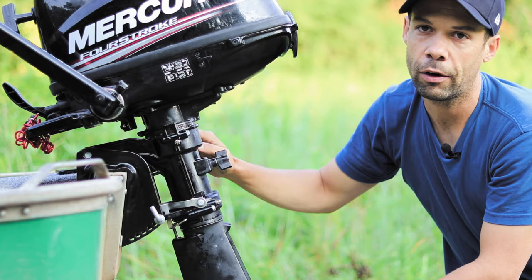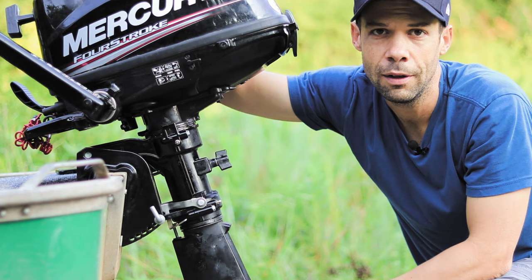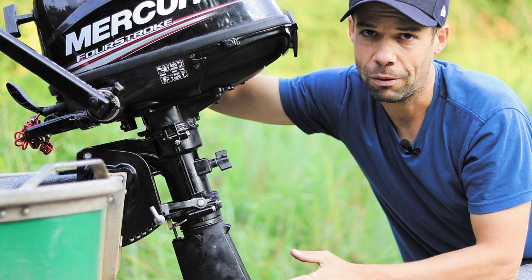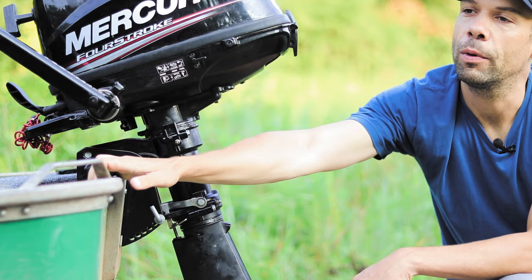When testing on the water, never start with the most aggressive position because that puts the most downward pressure on the back of the boat. The whole point of trim is to put downward pressure on the back to get the front end out of the water, which lowers surface area and drag. At one point you hit equilibrium — as level as possible with the least drag — and that's your optimal position. In the most aggressive trim, if you've got a heavy boat in the back you could actually take on water over your transom.